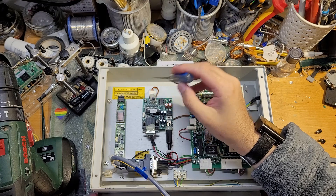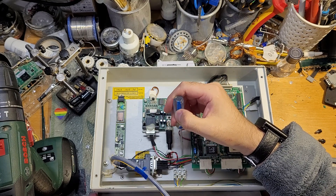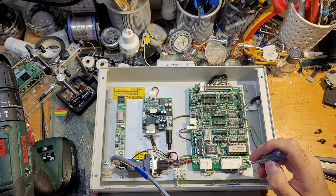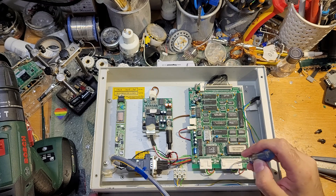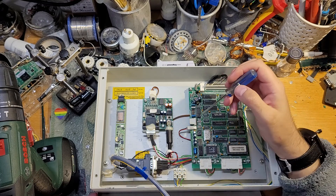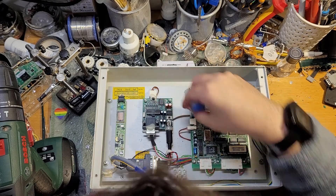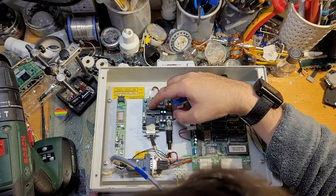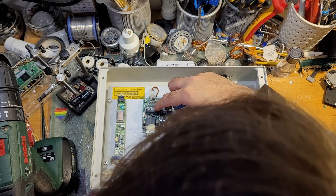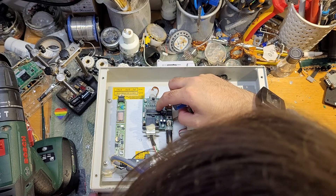This is our touchscreen interface serial board. Once again, RS-232 output that goes into this connector here. This one does the communications from the terminal as a whole to the output port — it's out of camera sight. This uses a little Motorola microcontroller, which is a MC6AHC7... is that an O? I've never seen O in a part number before — 5J2CP.